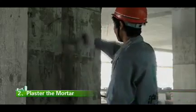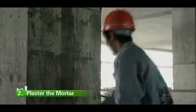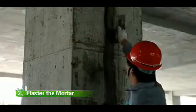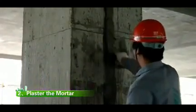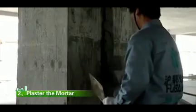2. Plaster the mortar. Dust before plastering the mortar. Wipe off the dust on the concave convex groove surface of the wallboard with a wet cloth or professional tools. Humidify the groove with water and then plaster the professional caulking polymer mortar inside the groove of the installation wallboard and the floor baseline to smooth the wall space.